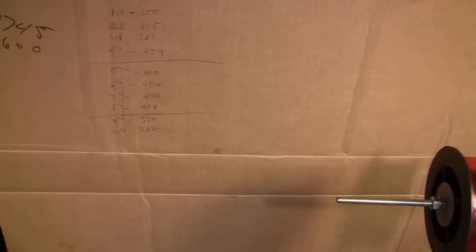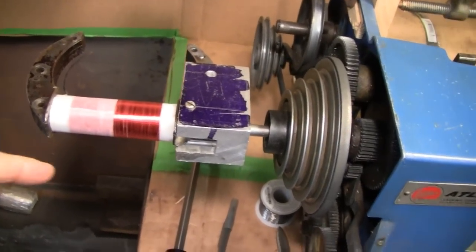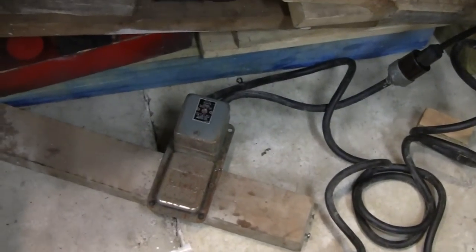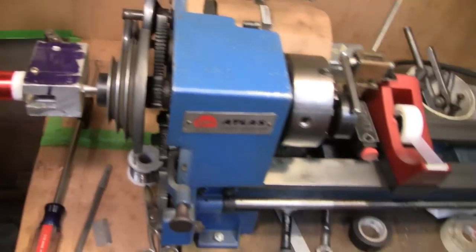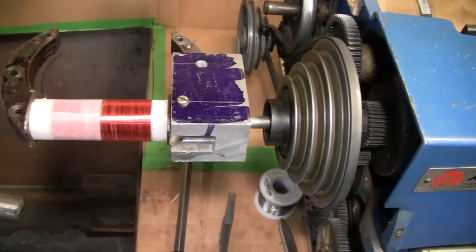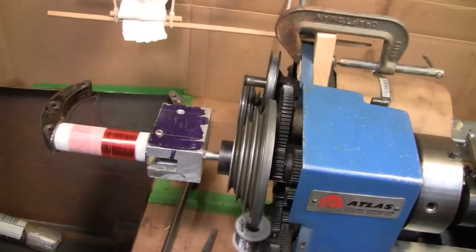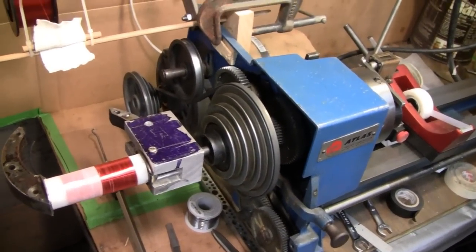He's down to 370 on one layer and 382 on another. Because when this is winding, you don't want to keep starting and stopping it, because that wire is so thin — every time you do that, you have a chance of breaking it. I've got a little gas pedal hooked up for him, but it's just on-off; it's not like an accelerator where you can start the machine slow. It sort of jumps on. He only finished halfway when he left, so I'm going to finish that up and then keep going. I don't know how many layers I'm going to put there, but maybe I'll throw a camera up so you can see it — just for posterity, right?